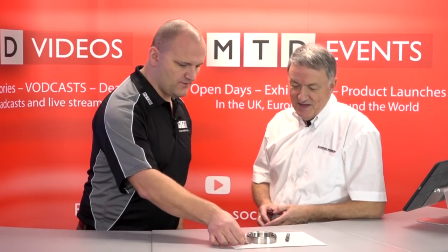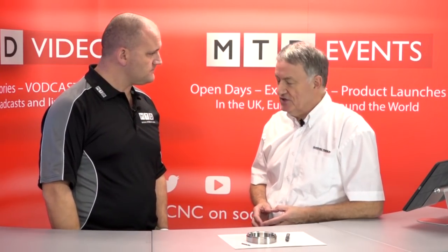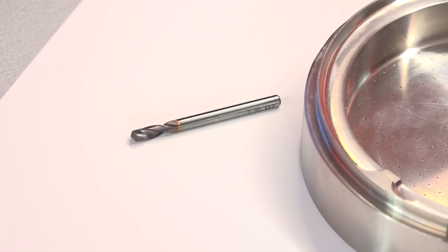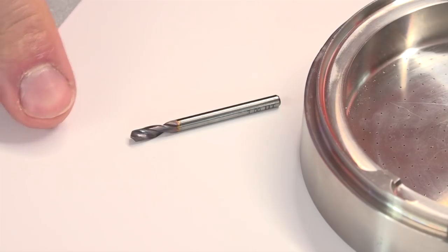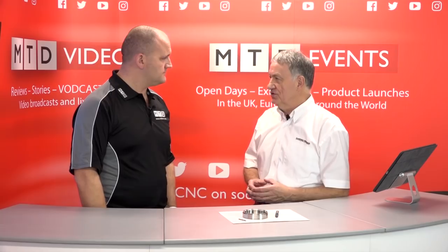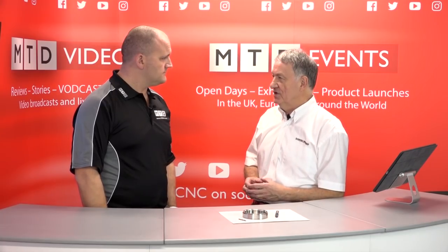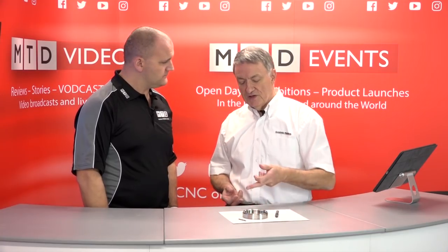And the drill — is this part of the Union Tool range as well? Yes. It's one of our favourite tools within the range. It's a C-UMD drill. It starts at 0.1 millimetres and in stock we have every drill in a 10 micron increment up to 2mm, and then from 2 to 3mm in every 50 micron increments. It's a get out of jail card for customers, particularly if they're micro drilling, because it has a 150 degree drill point angle.